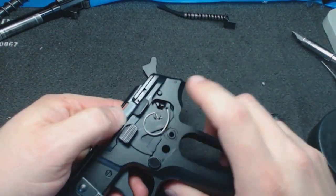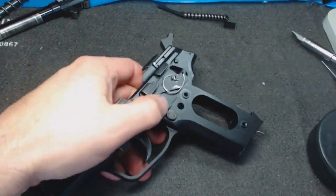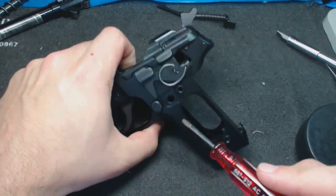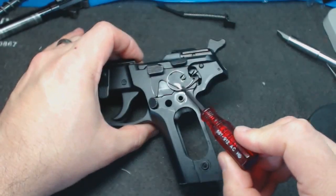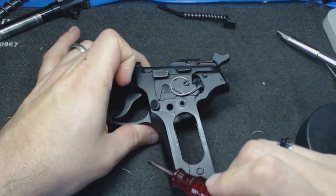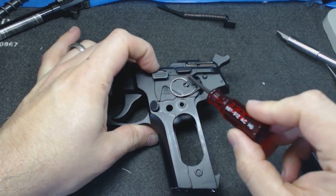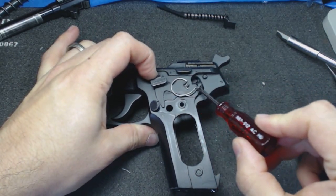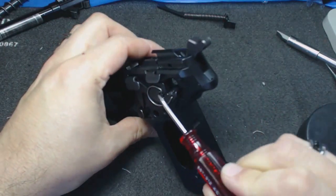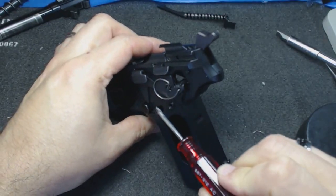All right. So the first one we're going to take off here is this mechanism, and it's actually fairly clever and brilliant, all in simple ways. This spring, not only is it the tension spring that's making that flop back up, basically as we push it down, we're winding this coil, so naturally the coil wants to unwind, but it's got a self-retaining mechanism.